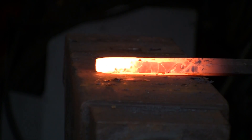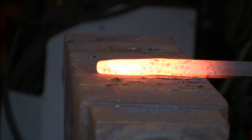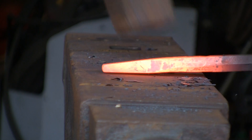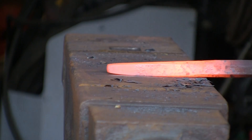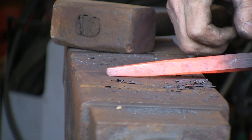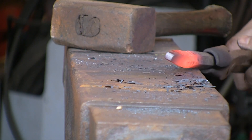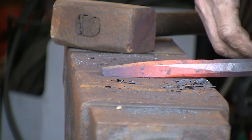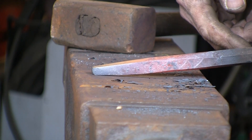You can see it's pretty tough stuff, this Allen key material. I have no idea what it is, but if it's good enough to use as an Allen key it must be pretty good to use as a punch. Now you can see that's drawn down to about three-eighths of an inch square on the end. So if you wanted to make a three-eighths square punch you just tidy that up and leave it as it is — that's your punch done.